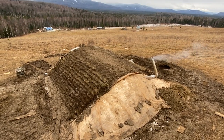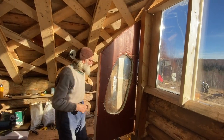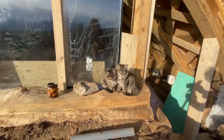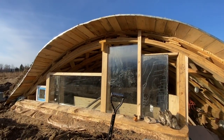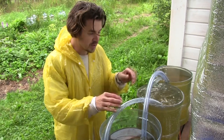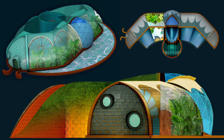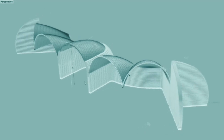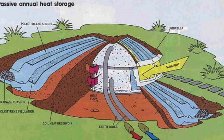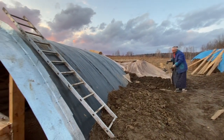You'll learn how to place arches so they don't pop out, create a fresh air intake that is passively heated for winter, calculate basic engineering to make strong and sound structures without an engineer's help, and how to waterproof the vault using low-tech and robust methods. This hot waterproofing method is especially designed for flat roofs as well as vaults. You'll also learn how to make a clay lock so that grass turfs do not rip and pull down the insulation, and how to make a door for cold climate using insulation and triple glazed windows.